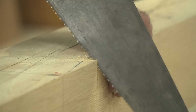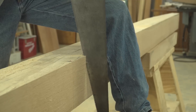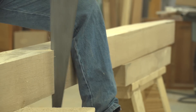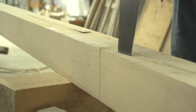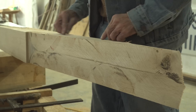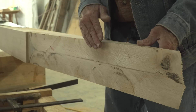Then I'm going to take a hand saw for the things that the skill saw won't do. I could actually make this cut across with the skill saw — it wouldn't be that hard at all. But making the continuation of the first cut would be very, very difficult — you just can't do it. So I take a hand saw to that too. I'm ripping and cross-cutting really with the same saw, but it's seven teeth per inch, so it's pretty aggressive. There are the two cuts right there that I made — one from one side and one from the other — and the line's still there. It was pretty easy because I had a batten to follow.